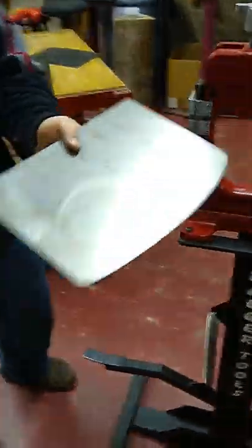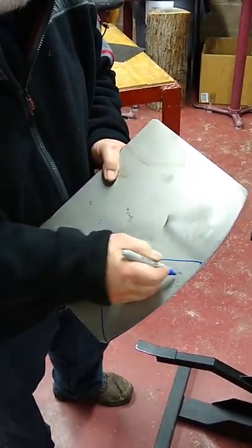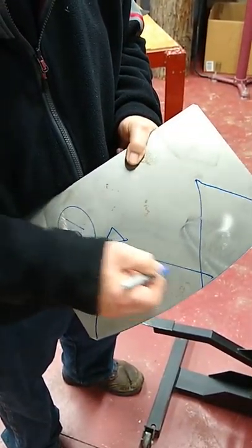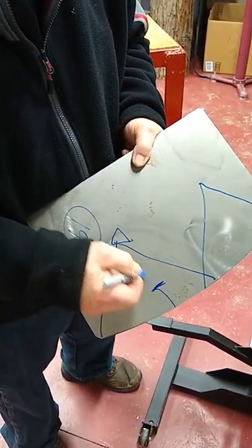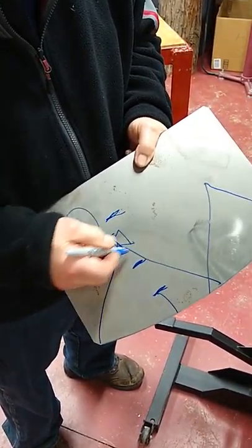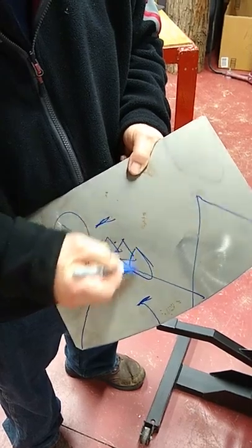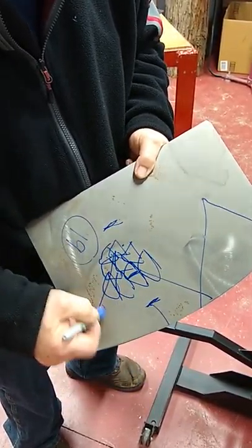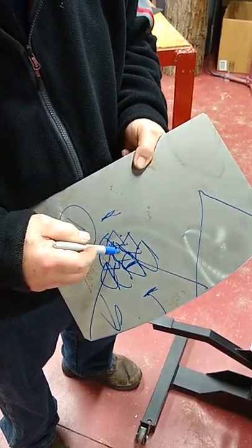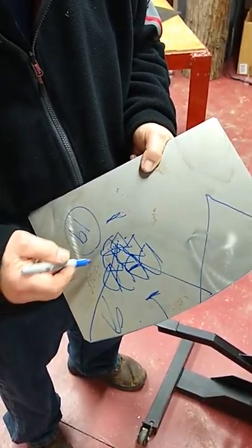We're going to jump over to some flat sheet. One of the things we've taught our students over the years is we tend to like a diamond interlocking type of patterning. Because of the depth of this machine, we can go in a little bit, medium, or a lot — that's a consideration you have. Normally we start with a couple of shrinks overlapping, then create another row to enlarge to three, four, and so on as we work to the edge. We can start lighter and work heavier, or stay light throughout.